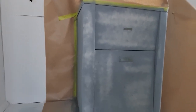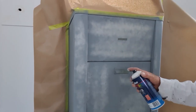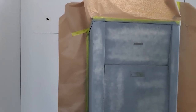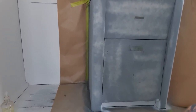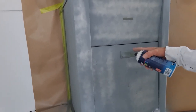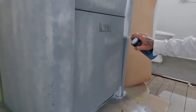I've let it sit for about half an hour and now I'm going through with the Duramax. This was sanded, dusted, and then primed with the Dulux metal shield zinc primer. Now we're putting on the top coat - everything's taped off, everything's had a good dust down. We'll just start going through and put on the top coat.